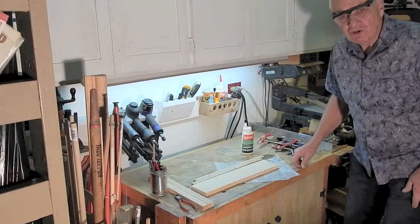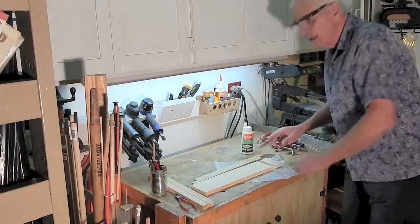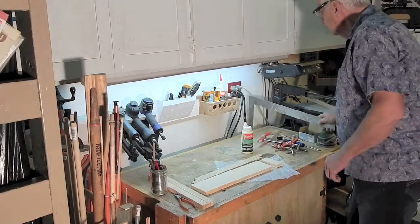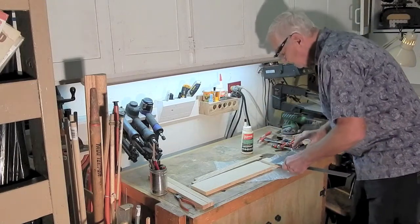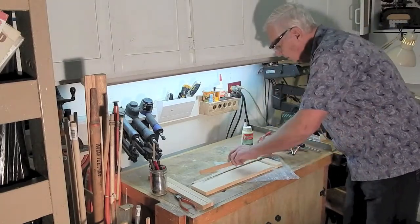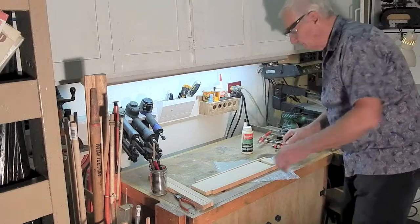To make the front skirt with the slot for the Extend Retract Lever, I just cut the piece of plywood so I could create a 7/8 of an inch slot, and glued a piece of hardwood to the top and the bottom.